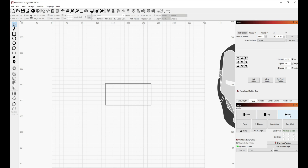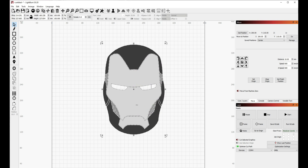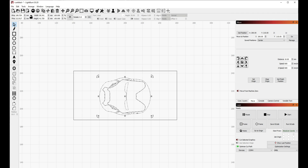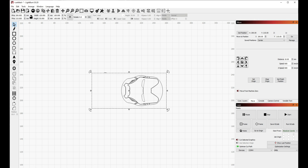I let it go and cut on the cardboard. Once the cut was done, it gave me a perfect little square. If I want to take a logo, I drop whatever picture I want — depending on the clarity, I can right-click trace and move the threshold. The threshold picks up the tolerances of the color — no eyes, now there's eyes. Cool. Now I have a trace pattern. I can resize it and rotate it 90 degrees. I engraved the back of a remote: I cut the square, did the math, figured out how big the square was, and engraved this logo on the back of it. Now I know exactly where it's going to engrave relative to the remote.